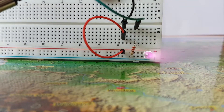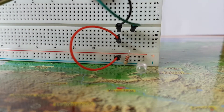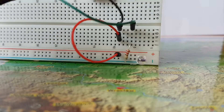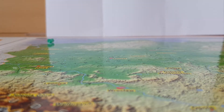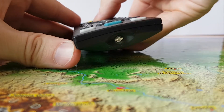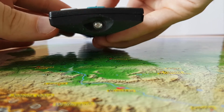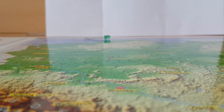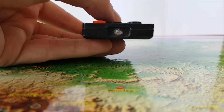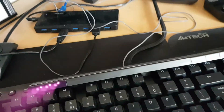It's that simple — you just take a cell phone camera or any other camera and infrared light becomes visible to the human eye. It usually appears purple, and you need to look perpendicular to the light source to make sure the LEDs are glowing, because some LEDs might not be powerful enough to see from another angle through your camera. So make sure your camera is perpendicular to the LED and then you can tell whether or not it is working.